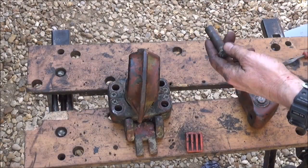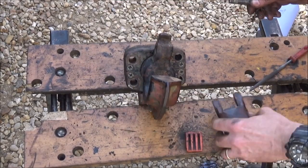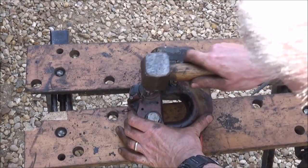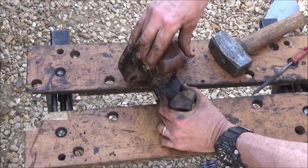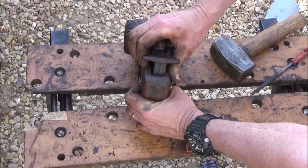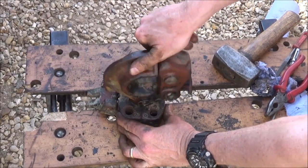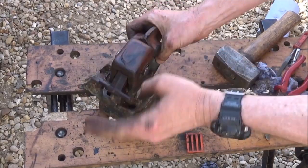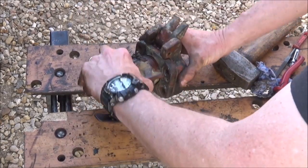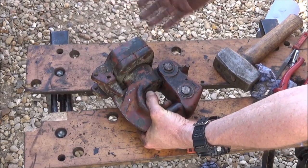Moving back to the main part of the hitch — we've got to clean up the pin at the top. We'll just dab a little bit of grease on this, get the attachment in the right place, and push the pin through. Locked up. Now hopefully that should open and it's positive lock. Just the E-clips to do and then we're good to go. Both the E-clips are in. Got a nice swivelling NATO hitch that opens nice and easily, closes nice and easily. When you're towing there should be a pin that goes through there, and I also need a pin to stop this so that when you're driving, if you want it in fixed position it just clicks into place there. But apart from that it's good to go.